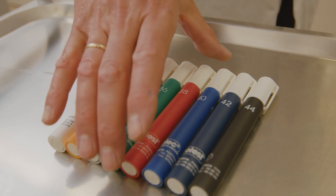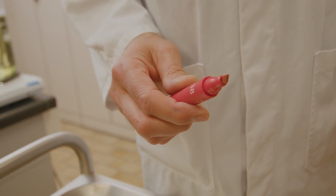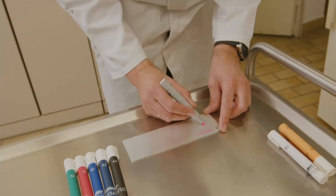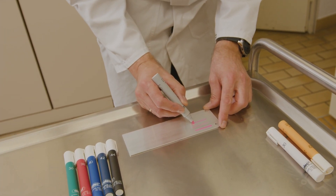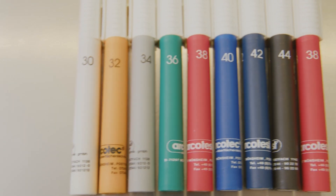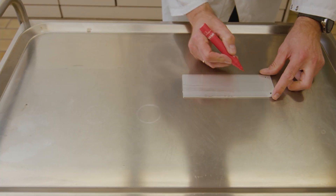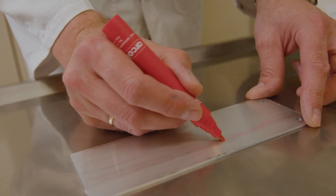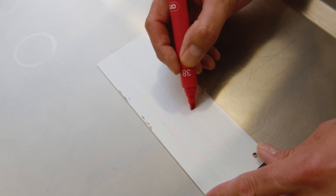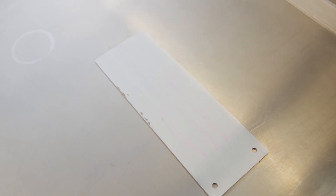A more complex possibility is the use of special test pens and test inks. These contain liquids with a fixed surface tension, which allows a more precise classification of the cleaning degree. The test pens shown here have a surface tension value between 30 and 44 millinewton per meter. Run the test pen over the dry surface and look at the marking strip. If the marking strip contracts, the surface is not yet sufficiently cleaned at this surface tension. If it remains in its original shape, the surface is clean.